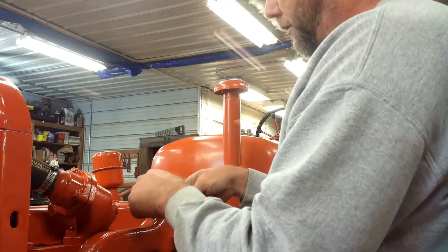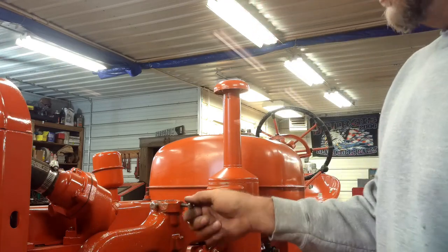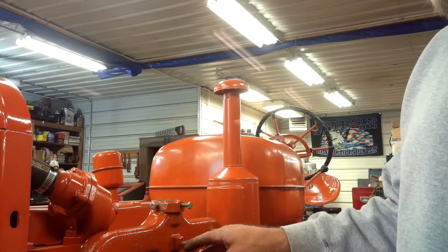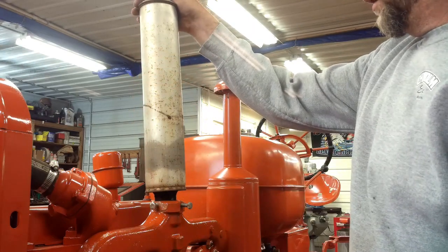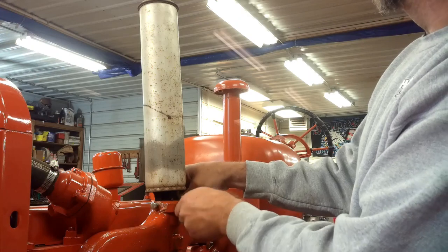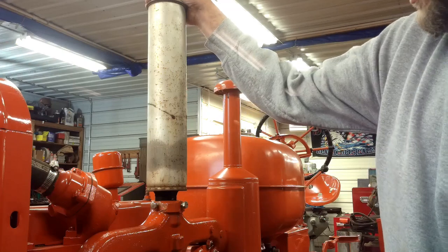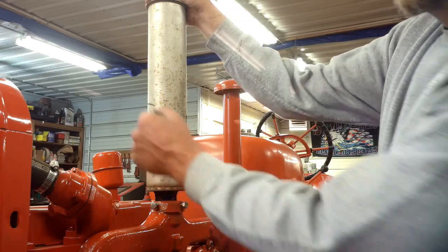Final thing to do before I try this is put the muffler on. A lot of these tractors use the Nelson style muffler that sat on there with a heat shield and two bolts. This manifold — I don't know if it was replaced at some point or what the deal was — it's got the boss there but it doesn't have the threaded hole. So I'm just going to put the muffler back the way it was; these bolts basically act as set screws. I know some people aren't going to like restoring a tractor and putting this old muffler back on, but it's in good shape and after a year it's going to look like this anyway. Maybe in the future when it does need replaced I'll buy the Nelson style and just drill and tap it at that time.